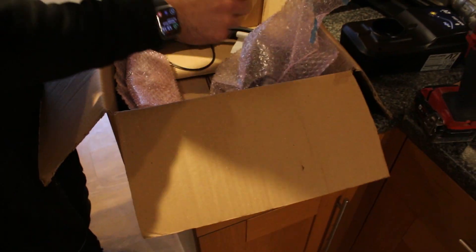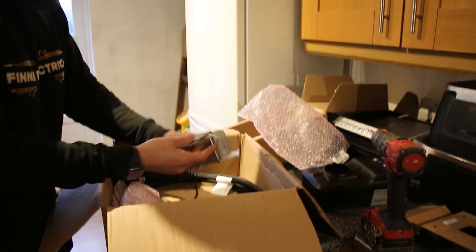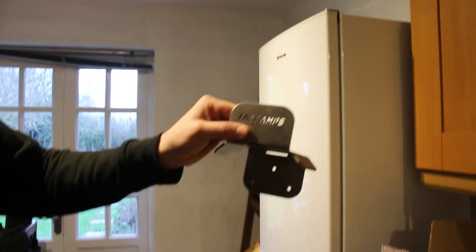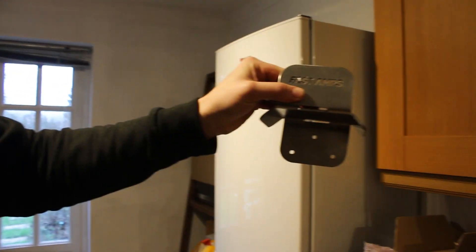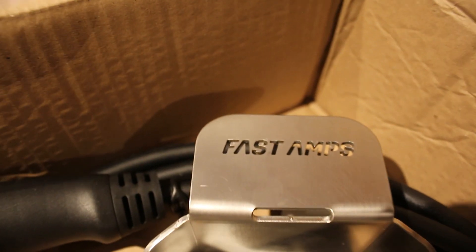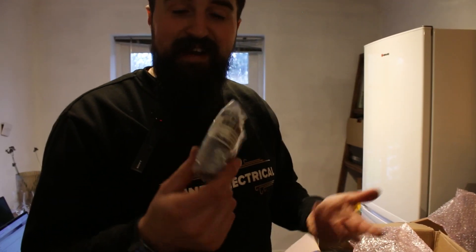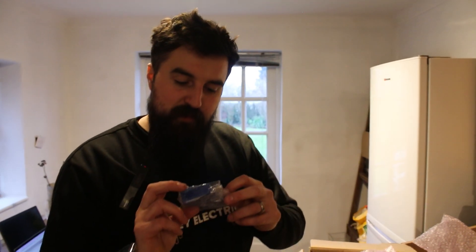You've got three terminals for your solar, your dynamic load, and one for your CT. And in the box there's also a mounting bracket - two parts to it - which goes on the wall, and below that you wrap your cable around. You've also got your CT clamp which is just going to measure the house load and make sure you don't pull too much. So we'll get that installed later.